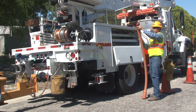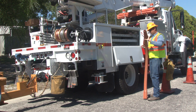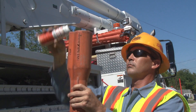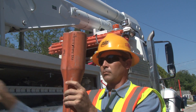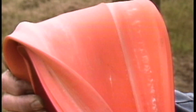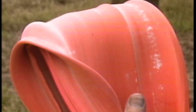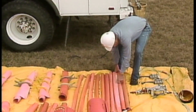Typical signs of damage include cuts, abrasions, punctures, burns, and embedded material. All surfaces should be clean. Contaminants such as dirt, oil, and grease on the protective gear can cause current to track across the surface. After the outside of a section of line hose has been inspected, the line hose is peeled open and the inside surface is checked for damage. After each section is inspected, it is placed on the tarp.